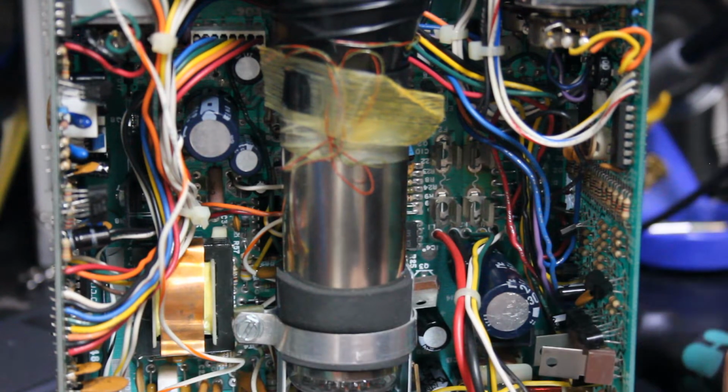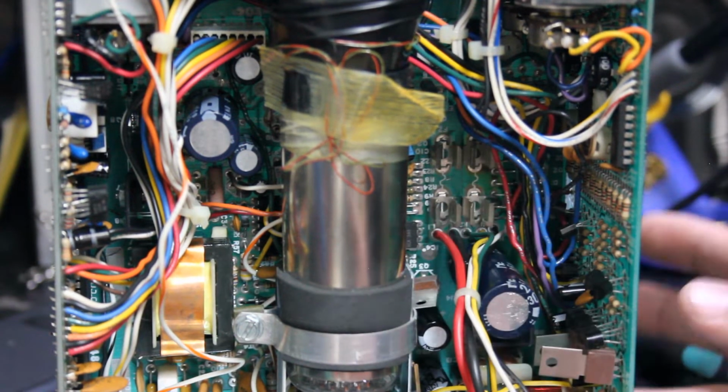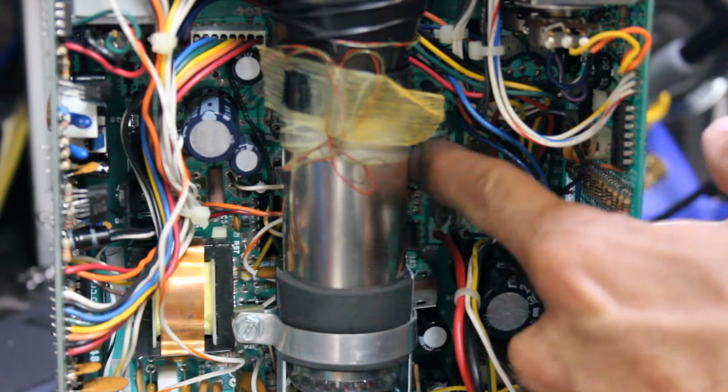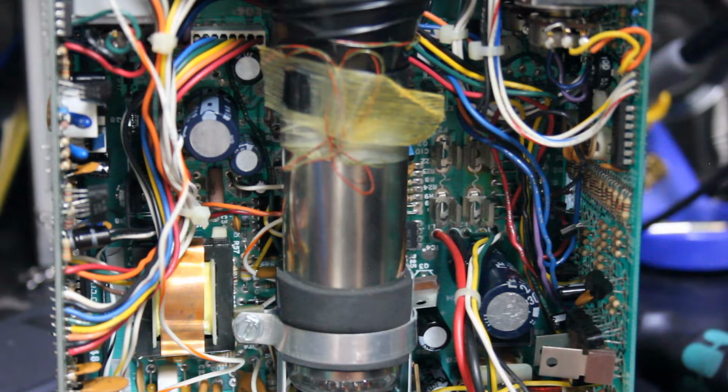And I think the best course of action now is, because number one, I don't have the correct fuses in stock either, but I also don't want to put fuses in there, blow them up, and then be back at square one. So I'm actually going to short the fuse connections. I'm going to put jumper wires on it, and then we're going to power it through the external power supply, that same receptacle here, but from an external current limited power supply so that we can ramp it up nice and slow, and we can see if there's a dead short in there somewhere.